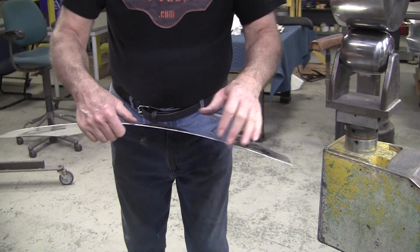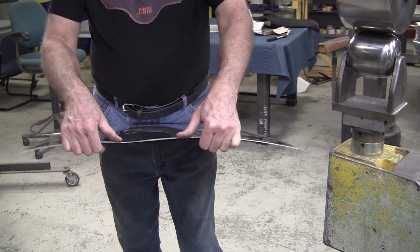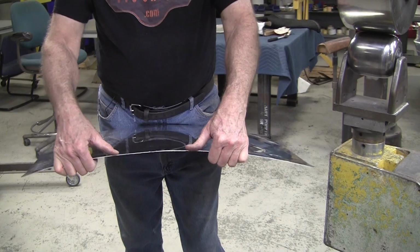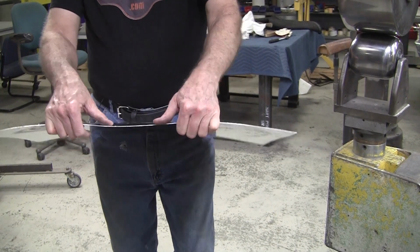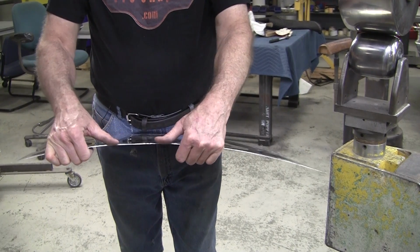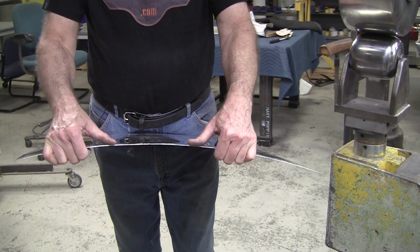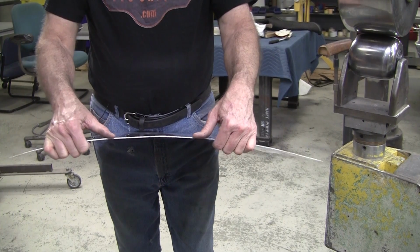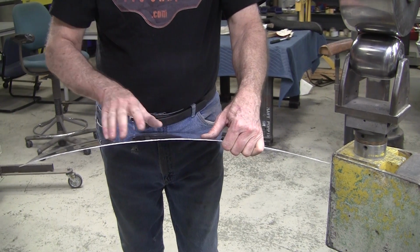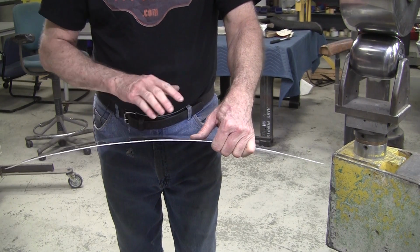All right. And I think I've probably mentioned it before. When you're building panels, shaping them to start out with, this is a very, very common thing you're going to see on just about every panel, a loose edge condition like this. In this case here, we want the loose edge. But in a lot of cases, you don't want the loose edge. This has got a little bit of reverse here, but if there's no reverse present, you don't want the loose edge.